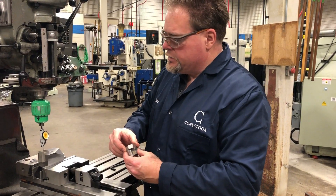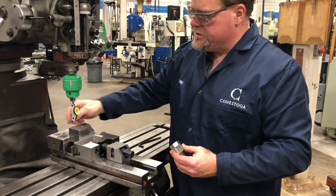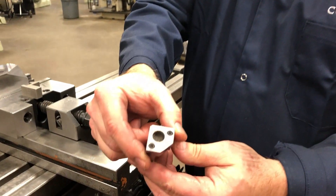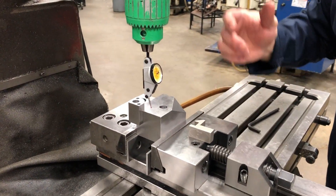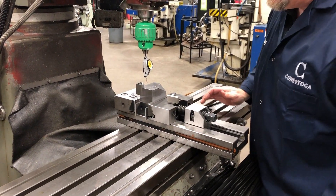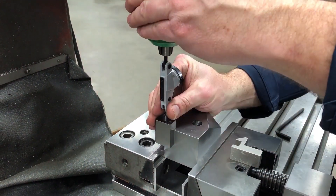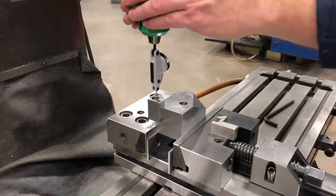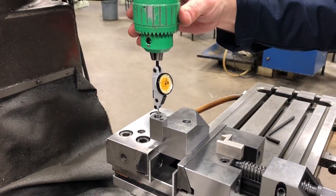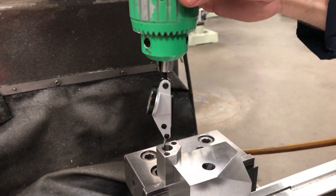So now let's say I want to pick up the corner — I have no other sides here except for this corner, but we can use the magnetic edge finder for the corner. Slide that guy on there, push it down, lower our z-axis, and then it's the same as indicating a hole. Once we've picked up this hole, we are basically over the exact edge of the workpiece — right on the corner of x and y. To pick up the hole, you just keep moving your x and y handles until the dial reads zero-zero. When we swing around, we're zero all the way around.